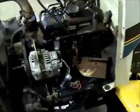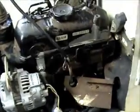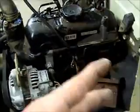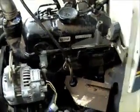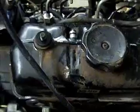But as you can see, I got the exhaust off. Take all 6 of the 12mm bolts out. That comes off. 12mm nuts hold the nut and cap on the top of the valve cover. It's got these little rubbers on here. The kit doesn't come with new ones, so you gotta try to save those. Now I'm gonna grab a screwdriver and try to pry it off real quick.